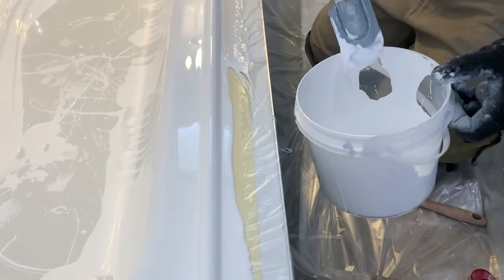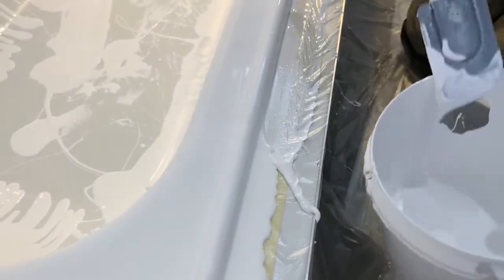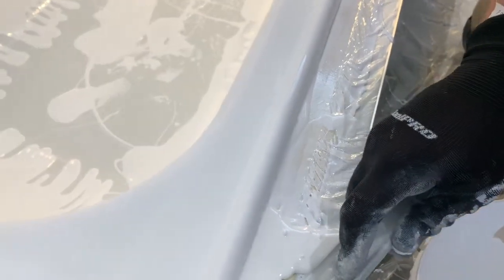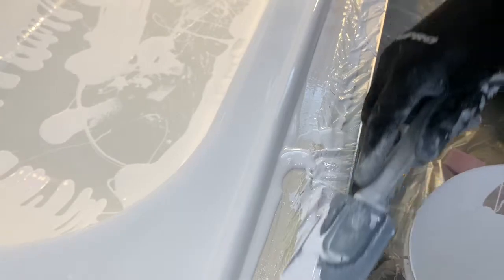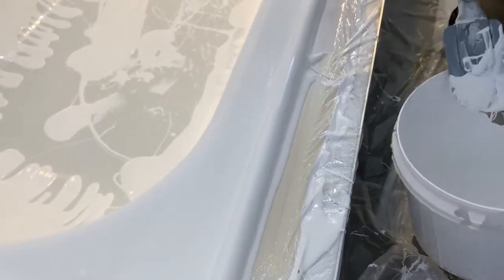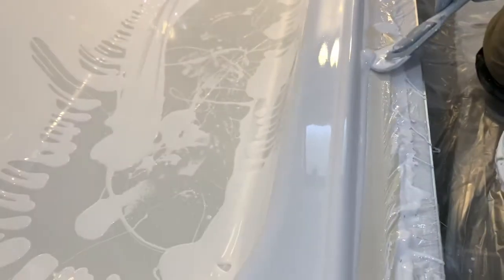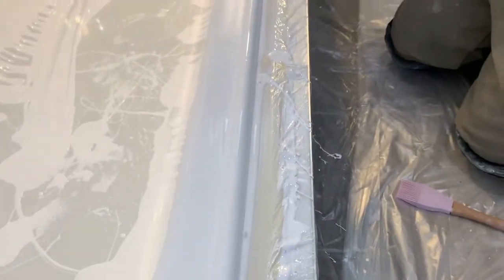Take that all off. And remember, we've put tape on the actual edge of the bath as well. The reason we do that is so that it doesn't go down the edge of the tile — we can control it a bit better. There's probably a little more product here than we want, but this is how you solve the problem. We're doing good, we're going to keep wiping until all this is off that ledge.